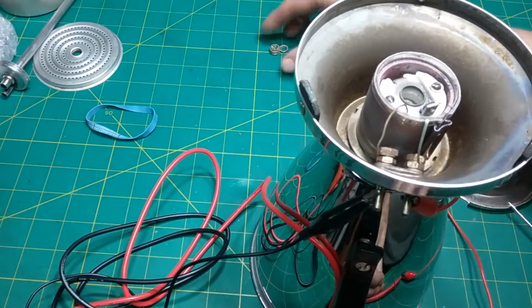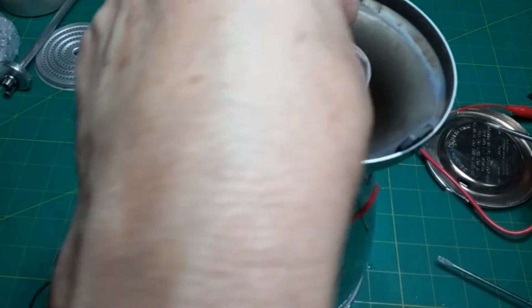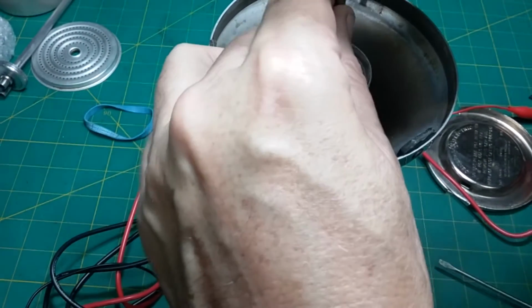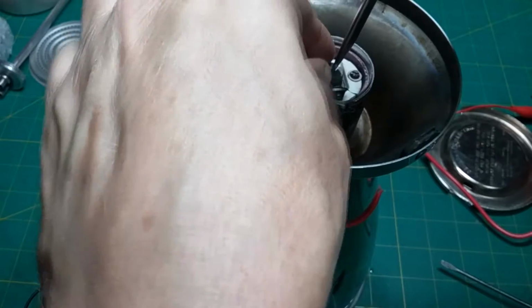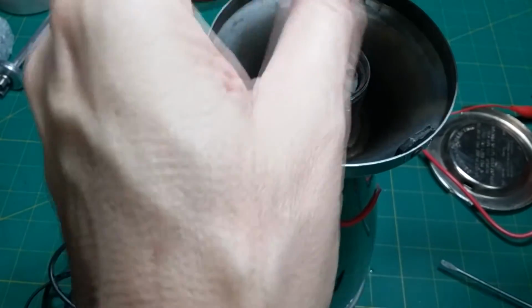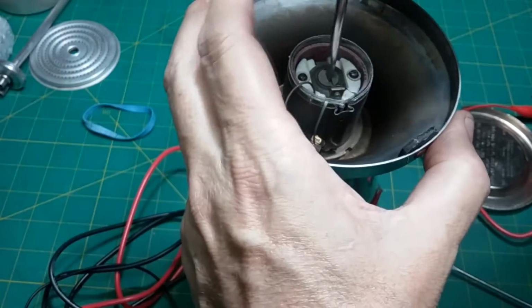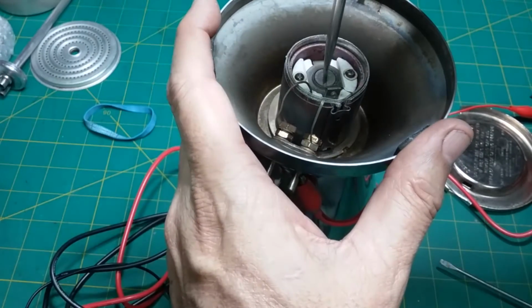Okay, so it's the fuse. This coffee pot will be on, if we get it working, it's going to be on its last two legs. Because what will happen without a fuse, well, there's still a piece of fuse in there, but what would happen without a fuse is it'd burn up this heating element, but this heating element's about on its last leg anyway.